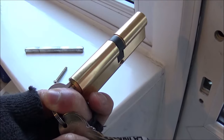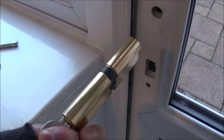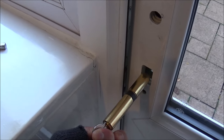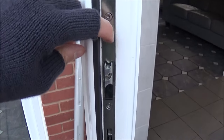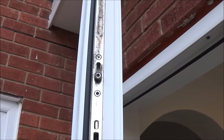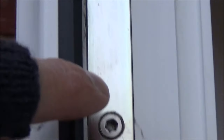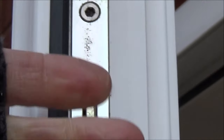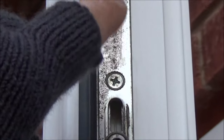Now this applies just to changing the barrel - this is the same principle. But I'm going to continue to remove the lock. This is how you change the barrel: when you get a new one, put it back the same way - push it back in and then turn the key. Now the next step is to remove this strip. If you look carefully, you've got Phillips screws and T20 Torx screws. Don't touch the T20 Torx screws, because the whole thing will come out without taking those Torx screws off. Just focus on the Phillips screws, because those are the ones holding this strip and the lock onto the actual UPVC door.